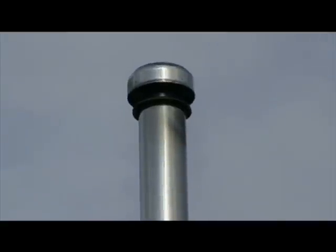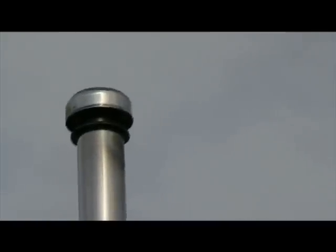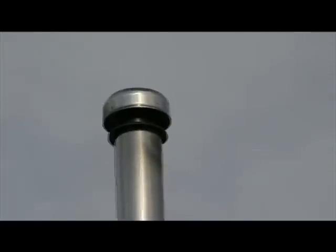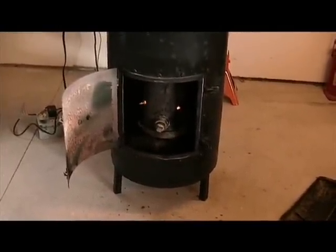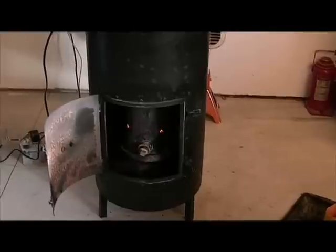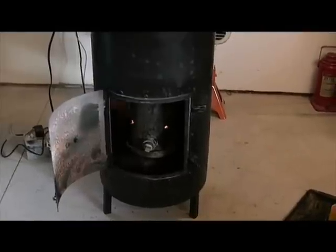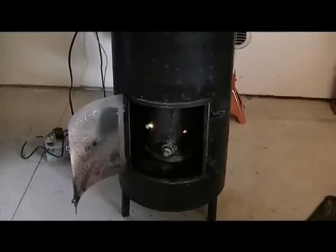One last thought — it's about 2:30 now. The thing's been running since about 9:30 this morning and it's running nice and clean. Kind of nice and warm in the building. It's a good little heater — it works. Still burning away inside, and it's about 68 degrees in here now; it started this morning at about 36. I can pretty much get it as hot as I want. Running it at about a half a turn brings the temperature up nice and easy and it's comfortable to work all day. If it gets too hot, I just crack the door and let some heat into the other section of the room.